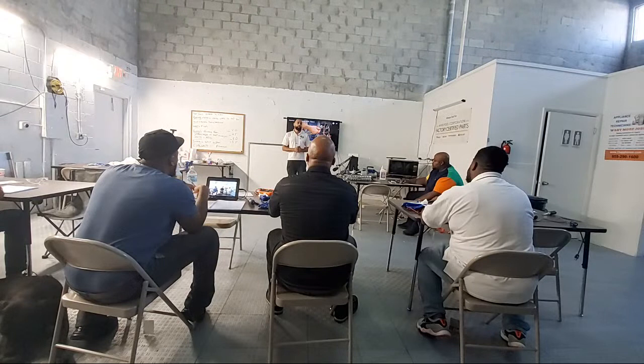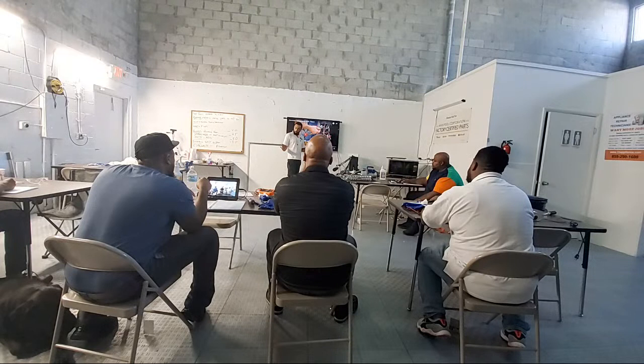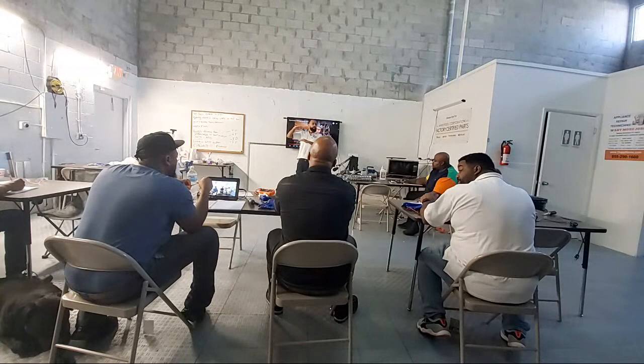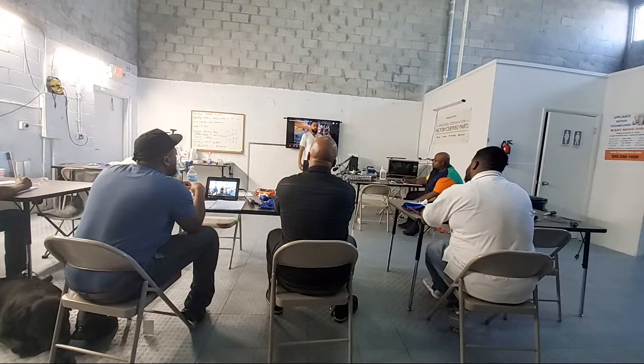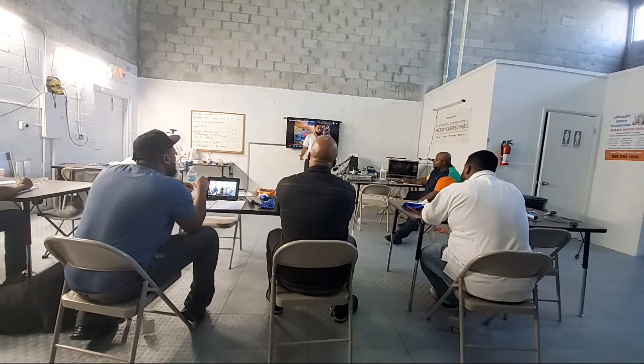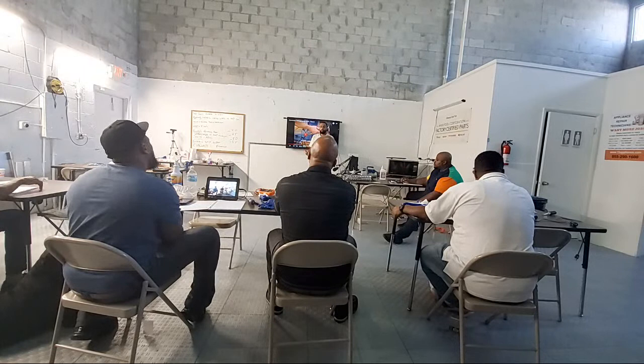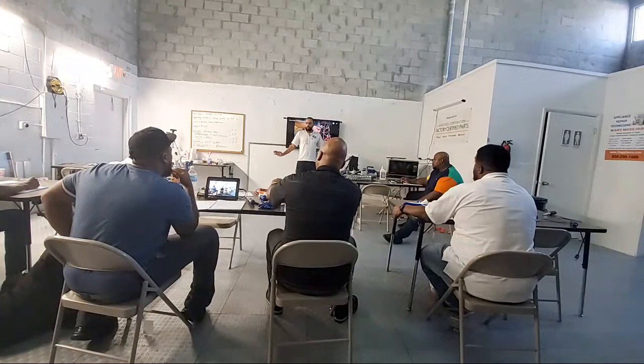Step one, no cool. We look at our user interface. We look at our thermostat, our temperature control. Is the unit even on? And if it is, if there's preset temperatures on the UI, you know, 33 and -2, whatever the customer decided, that refrigerator should try to mimic those numbers. But we're the technician now, so our job is not doing that. Our job is to verify why it's not doing that. Since y'all been in this class, everything we've shown y'all has been with numbers, with measuring devices. Nothing's off the cuff. Nothing's guesswork. All stuff that you can put a tangible reading to.